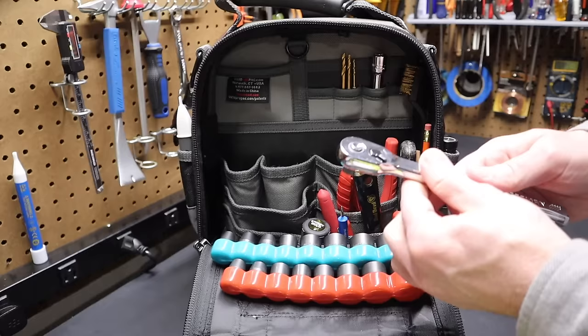Moving to the other side of the bag: in the zipper pocket at the top I have a couple of powdered mechanics gloves — literally just two — in case you're doing something dirty. Down here I have a GFCI tester. You plug it into any receptacle and a couple of yellow or orange lights confirm it's wired correctly. It also has a button to test GFCI outlets. Just handy to have.